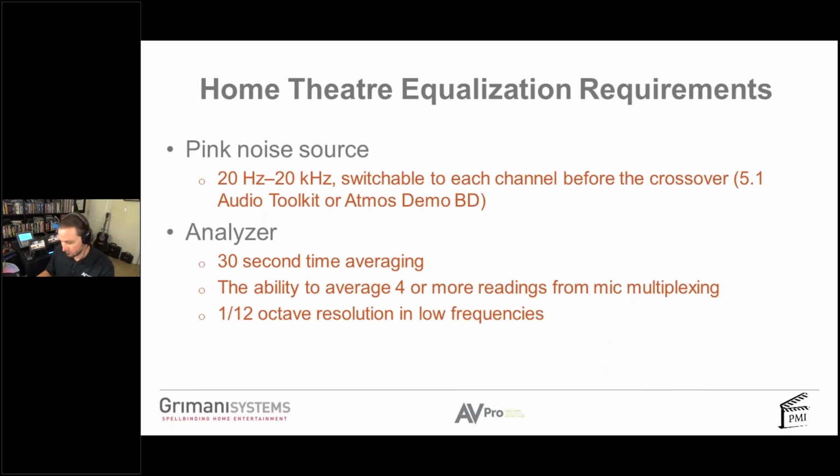How do you get the HDMI signal off your laptop to a surround decoder that's 3 stories down? The way you do that is you either have a USB or HDMI balun and a really long Cat5e cable, or if you planned ahead, there's an actual game port, quote-unquote, or a way in the room to feed that signal. Usually 1 or 2 Cat5 cables is all you need to make that happen.